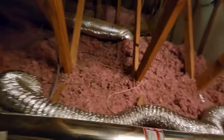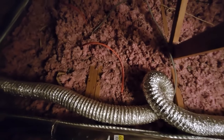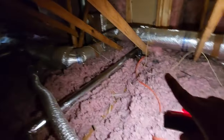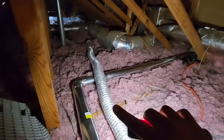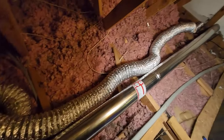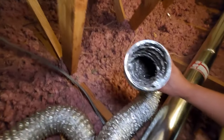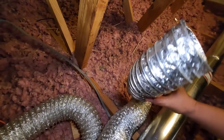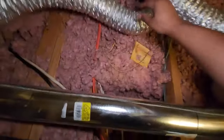Let's get started. They use this coil line — it's really bad. It gets clogged up and it's not straight. That's the old line and that's my new line right here. All I did was go up 90 degrees, straight pipe, nice and clean all the way out. This old coil line is not up to code and it's clogged up. I had to pull a bunch of lint out. This is not the proper way — it can actually cause fire. The new straight pipe cannot.